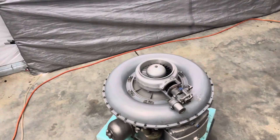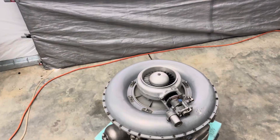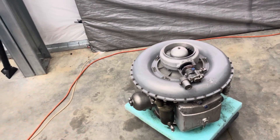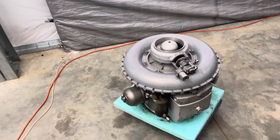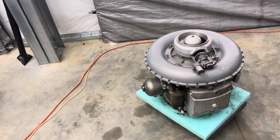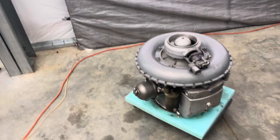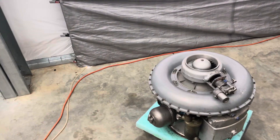This is an engine I purchased not too long ago, knowing it was no good and questionable. I think I know the history — I believe it was a complete turboshaft engine that was perfectly running until the owner let somebody else mess with it. They hot started it and cooked the blades. If that's the case, everything else was good — it had a good fuel control unit and so on. But I bought this engine knowing it had bad blades.